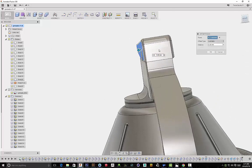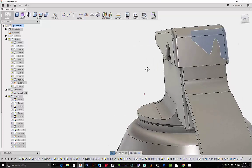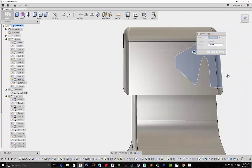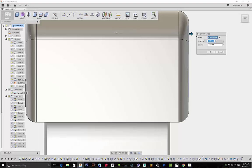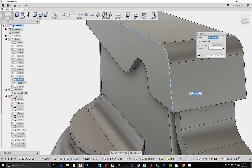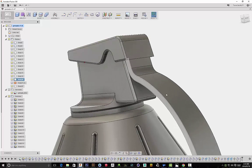The overall width of my spoon just wasn't correct, so I'm extending it and making sure the dimensions are the same on both sides. I wish there was a function to push pull faces symmetrically, but unfortunately there isn't. I wasn't happy with the fillet so I deleted it off the timeline and I'm playing around to see if a chamfer works better. I think I also replace this chamfer with a fillet later on.